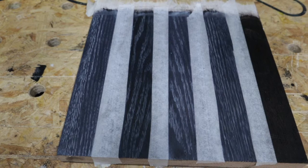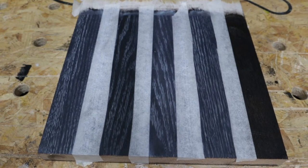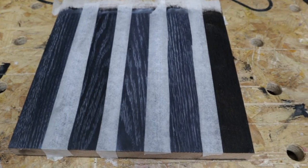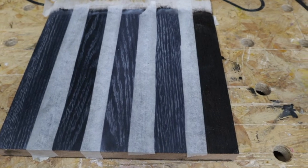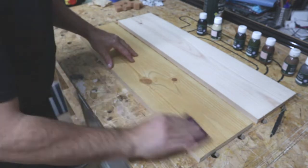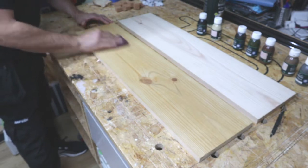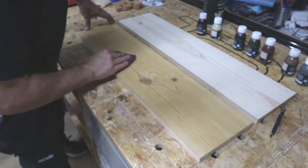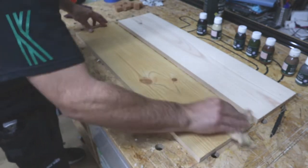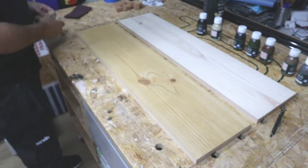Another one of my favourites is the Intense Black Pre-Colour. Going from left to right we have the white, white 5%, super white, cotton white, then a touch of gold at two coats over the top of it. This is 24 hours to dry, so we're going to take a red pad and give it a very quick D-Nib, because the Pre-Colours and Pre-Ages are water-based and can raise the wood grain a little bit. After doing that, just a quick wipe with a tack cloth and now we're ready to put the two coats onto it.